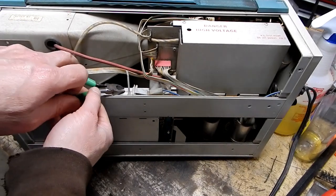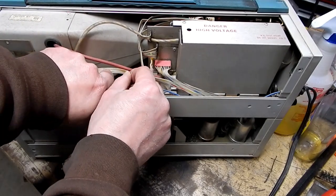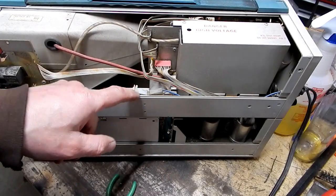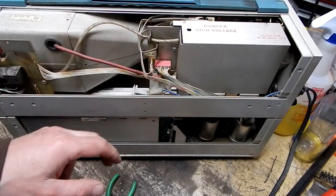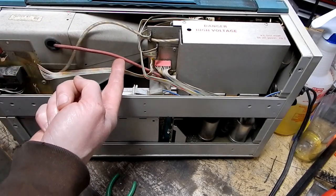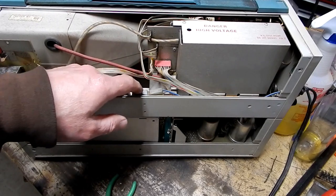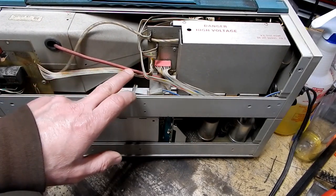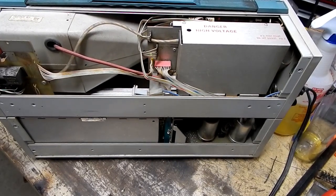Some of you guys are probably thinking: Steve, couldn't you have just reached down in and pulled that knob to turn it on manually? Well yeah, except for one thing. Notice what's right near here — this cover says danger high voltage, and this big red wire is the high voltage anode lead going up to the CRT. I don't really feel like having my hand here when I turn this on, in case the insulation has dried out and cracked somewhere and the electrons find it and chase me down ruthlessly.